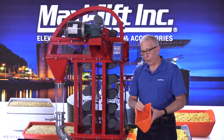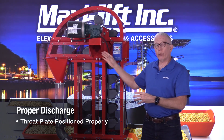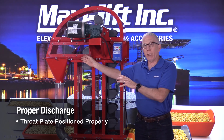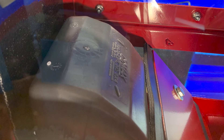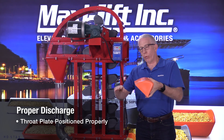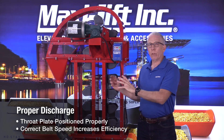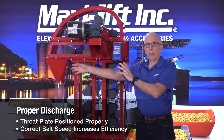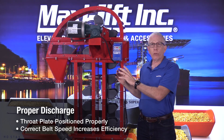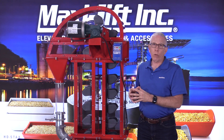Other things to consider with the head section: when you're discharging product, it's very important that you get all the product out. The throat plate needs to be in the right position, coming right up close to the edge of the bucket, so that as the bucket comes around and discharges, the throat plate is as close as possible and you don't get product coming back down. Speed is also very important — if you don't have the correct speed, product may get discharged too early and fly straight up and come back down, or if it discharges too slowly it may come back down on the downside.